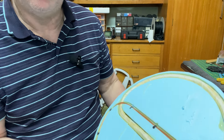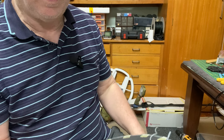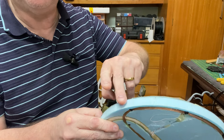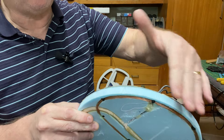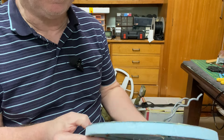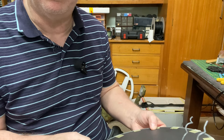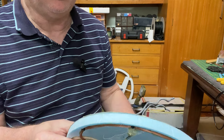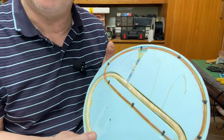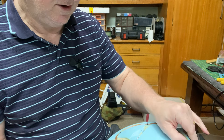So that's the double D. I'm only going to use the shell — not the foam, not the wire, not the carbon. I do mine completely differently. Even the carbon running continuously around the coil acts as a partial shorted turn and dumbs down the coil — anything circular and conductive around the coil will couple like a transformer and rob energy from it. This may have a more profound effect on the receive winding. There are ways to mitigate that effect, but should I give away all my trade secrets when commercial interests watch my videos?